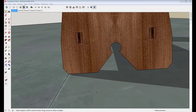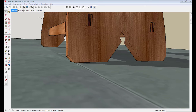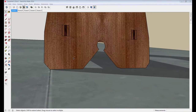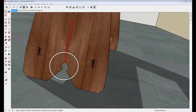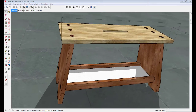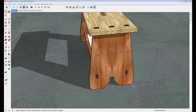The legs, looking close, are beveled on the sides. The bevel on this model is a little too big on this side — we'll change that when we redo the model. This round hole in the end is a strain relief to keep the wood from splitting in the middle. A feature I really like to point out to potential customers is that this stool is built with no screws or nails — it's all wedged tenons.